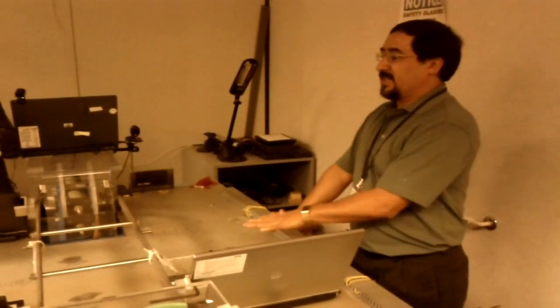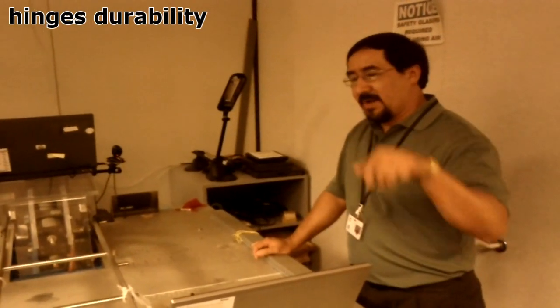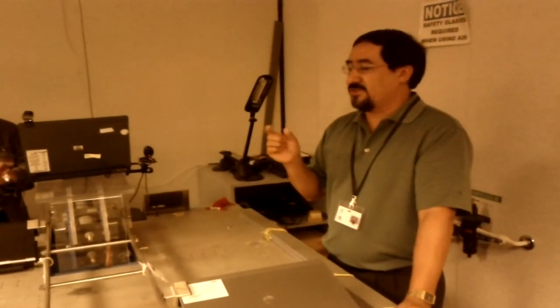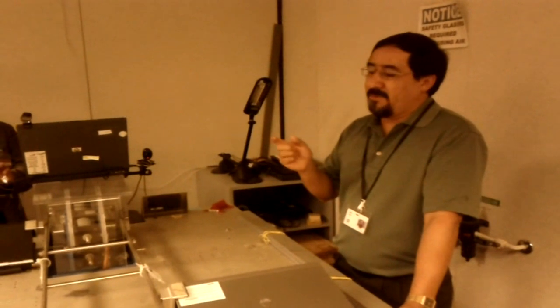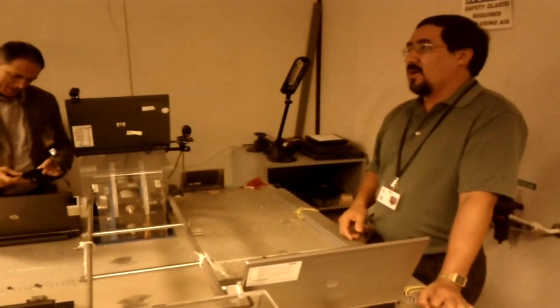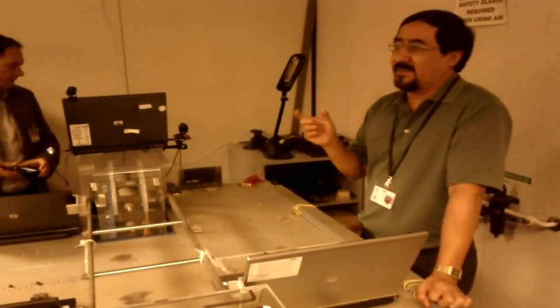Before we put products into this test, we've got some equipment over there that we use to test the hinges or the punches first. We want to make sure that the design is working well before we put them onto our materials. So we'll qualify the hinges first, up to over 25,000 cycles.